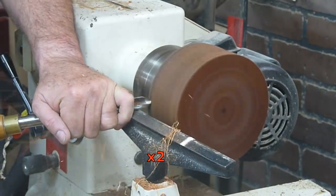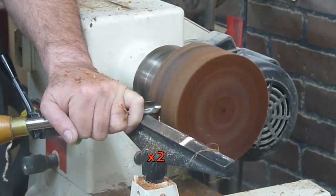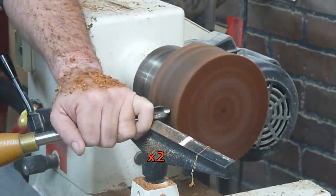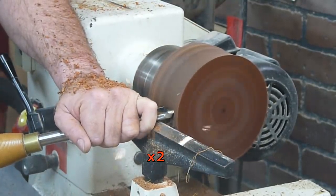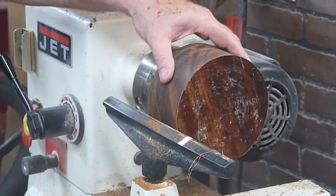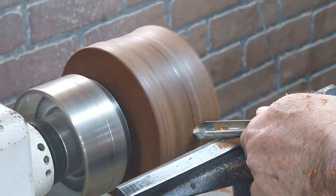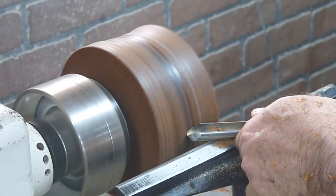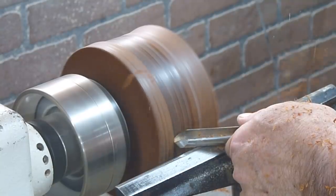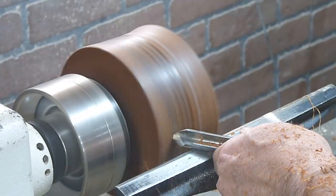Maybe it was just me being used to turning softer woods like I have in the past couple of videos, but it certainly didn't react the same way as the previous rosewood I turned. This was clearly a different type of rosewood, very evident from the feedback it was giving me. As the video progresses you'll see the gouge approaching at different angles so I can maximize the sharpness of the edge before I have to take it back to the grinder — making a pass with the flute at a different angle just presents a fresh edge.